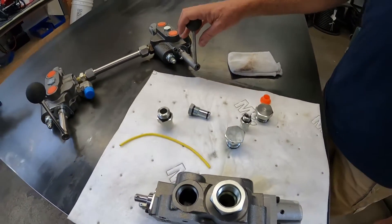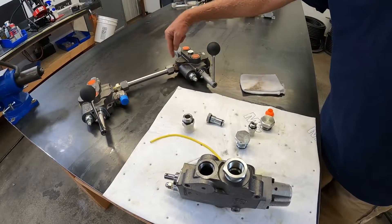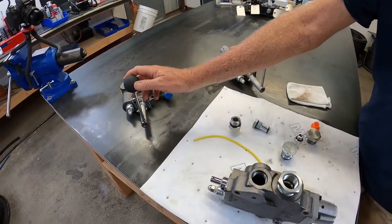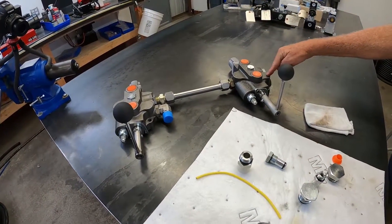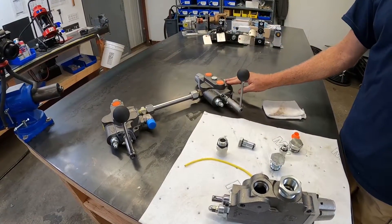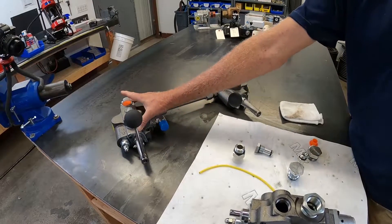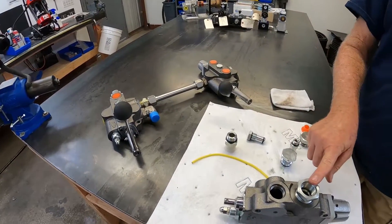A power beyond function is if you need to take fluid downstream from this valve and not back-pressurize the tank port of the first valve in series. As you can see by the setup I have here on our workbench, this would be your first valve in series. This is your power beyond connection going to the inlet of your second valve. Don't forget you need to run a tank line off the first valve. When this valve is in the neutral position, your oil is coming in the inlet port, through the power beyond port, to the inlet port, to the exhaust port. What that enables you to do is carry pressure downstream and utilize a second valve in your system. If you were to connect this line straight to your tank line, you're going to back-pressurize a portion of this valve that's not designed to do that.